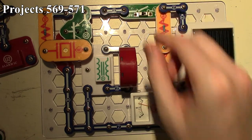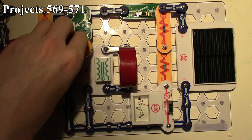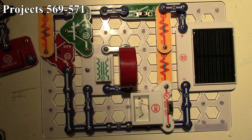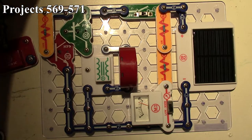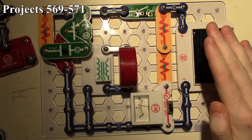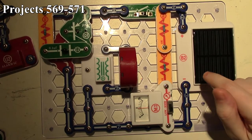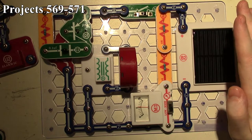Now project 570: Low Light Noisemaker 2. We replace the whistle chip with a 0.1 microfarad capacitor. By introducing more capacitance, as with previous oscillating circuits, we change the frequency, tending to lower it. With the 0.1 microfarad cap in place and the circuit on, it's oscillating at a lower frequency. You can also see that as we change the output voltage on our solar cell, that's reflected on the meter.